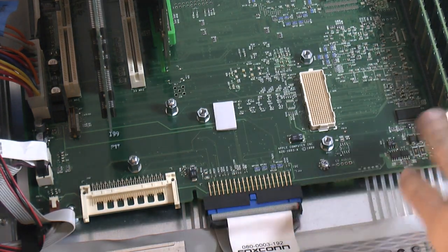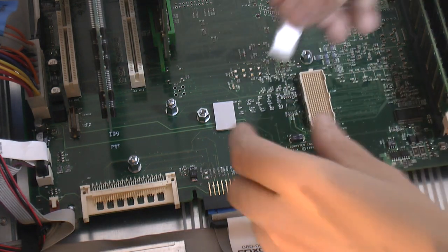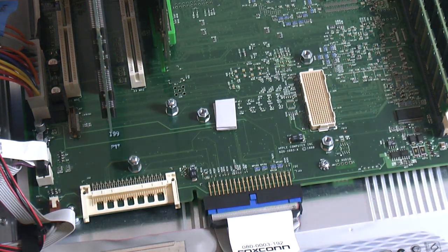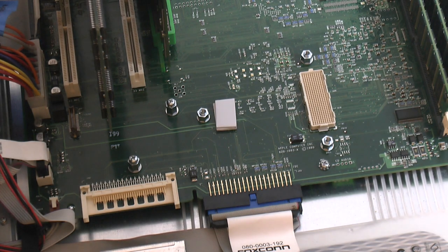The motherboard doesn't have any power or anything. It's all on the CPU board, so the motherboard runs pretty cool. It's not the best heat conductor, but it contains copper, which means it conducts heat fairly well. So I did some measurements and 4 millimeters of pads here, so 2 2 millimeter pads, since I didn't have 4. That should suffice for the bottom L3 cache here.